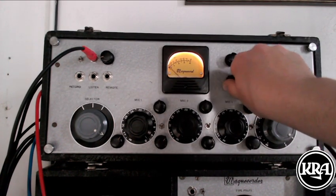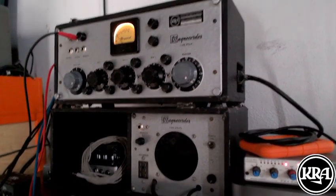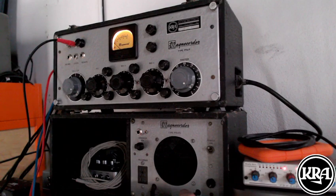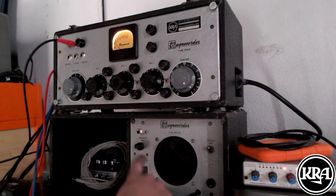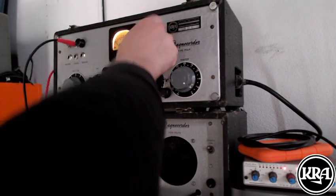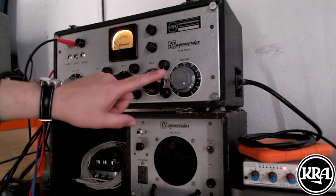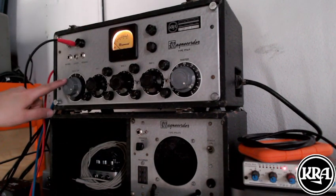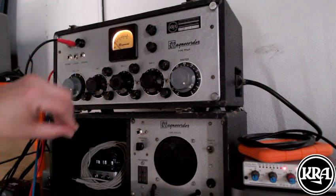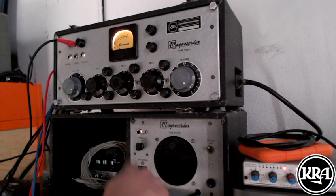This switch right here has four positions, and it controls the signal that is sent to this monitoring station. So what's going on here? Well, we have a volume control, and the signal being fed to that volume control is controlled by this switch right here. To its farthest right position, the signal that goes to this speaker is the right channel. The next position over monitors the left channel. The next position over is a mono sum of the left and right channel that goes to that speaker right there. And then the fourth position is connected to ground and is essentially a mute for the speaker.